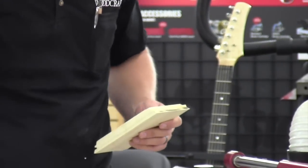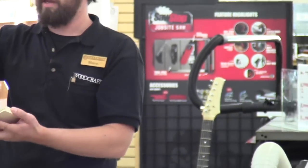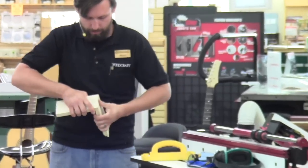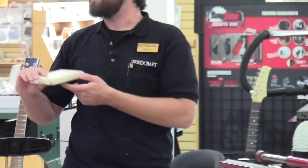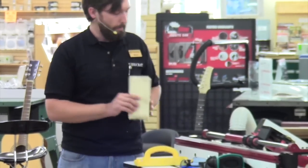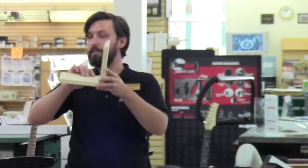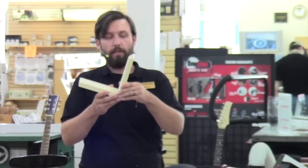A little bit of tear-out — that's all right. So now you can take your first board and set them together. You're going to look at that edge to see if they push together all the way and meet up. I'm going to have to run that piece through again — I must have tilted it slightly. You can run it again without changing anything to clean it up. What you want to look at is how this piece sits in relationship to the other: is it down, is it up? That will tell you if your fence needs to be moved forward so less bit is exposed, or moved back if you need to expose more bit.